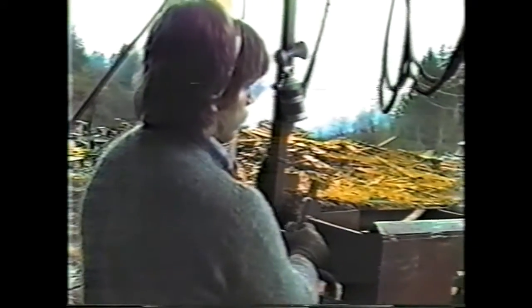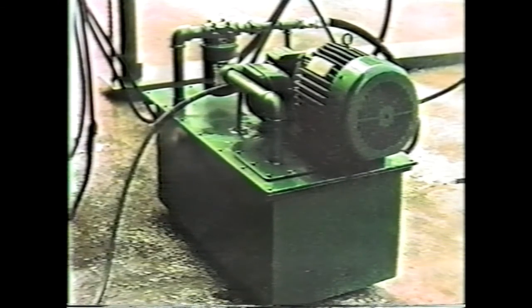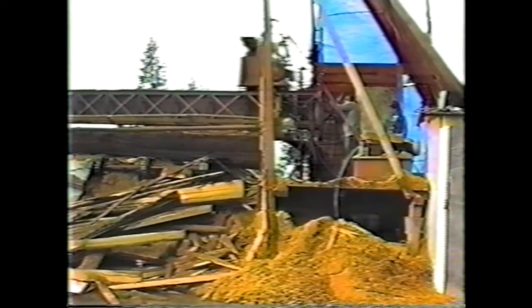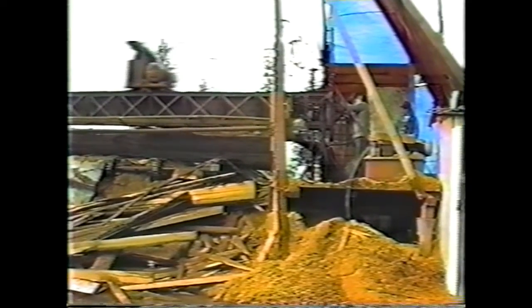The saw is equipped with an electric hydraulic system to control all functions. Operation is controlled from one end of the boom with hydraulic switches and flow controls. Provided is a 55 gallon hydraulic tank complete with a 15 gallon per minute pump and plumbing which provides very efficient operation of all the saw functions. An additional option is a fully hydraulic unit that can be run by a diesel or gas engine hooked up to the hydraulic pump system to drive the functions and the head and edger saws.